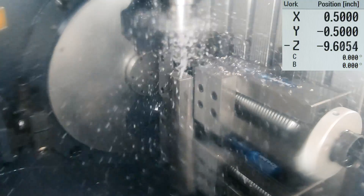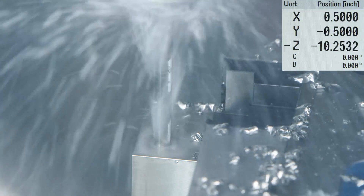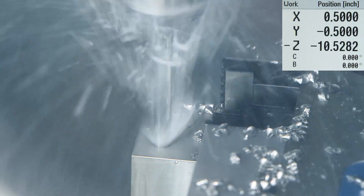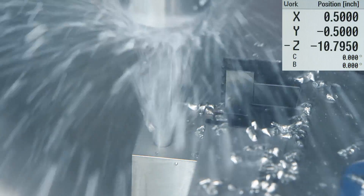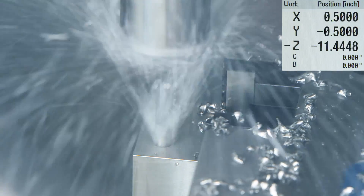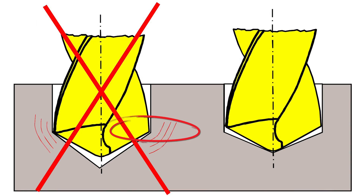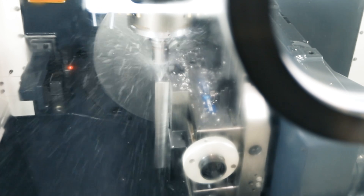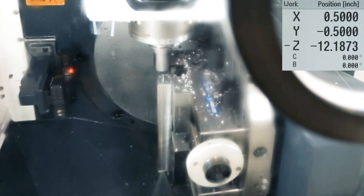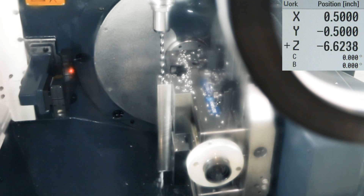You just want the pre-drilled diameter hugging the deep hole drill to position it perfectly, so as it drills deep it stays perfectly straight. Another important point: the tip angle of your pilot drill must be greater than the deep hole drill. You want the center of the drill to hit first — that lets you go straight and have a perfectly drilled hole. If the outside corners hit first you can chip them, which greatly reduces drill life. When I break through the bottom I'll slow down to 100 RPM and pull it back at 50 inches per minute, then repeat the entire process for two more holes with the exact same drill.